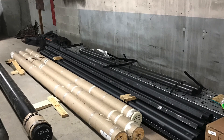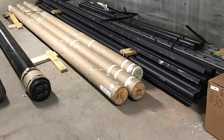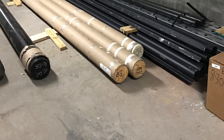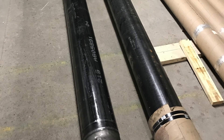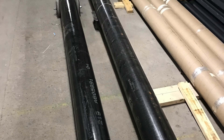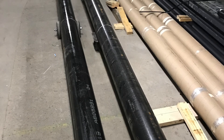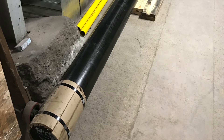There are a couple of important reasons why you should review your existing hydraulic piston and cylinder on your elevator. It will be important to identify when your elevator was installed and if there is any original documentation — such as drawings or manufacturers' information — identifying a single bottom cylinder. Prior to 1972, hydraulic cylinders were manufactured with a single metal bottom.